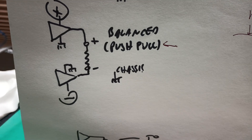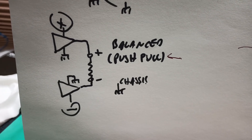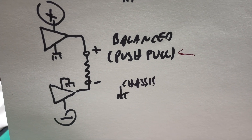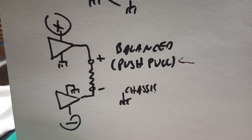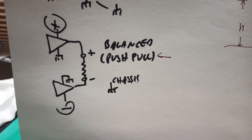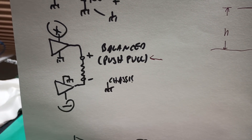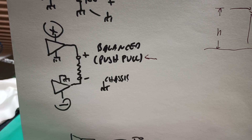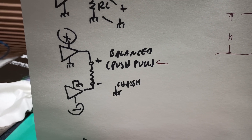This is well known in the public address and stereo system world, where the speakers are floating — they cannot be grounded. If the plus and minus and the resistor represent a speaker, and we ground the bottom terminal of the speaker, we bypass the lower amp and destroy the top amp because it draws way too much current. So push-pull really means isolated from chassis. The classical HP 651 generator has a push-pull balanced output that keeps it away from chassis — because there's a lot of noise on the chassis. That's where the idea of balanced and unbalanced comes from — it's not about transmission lines and not about antennas.